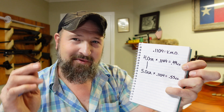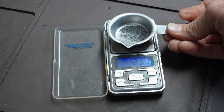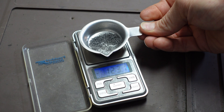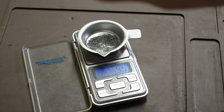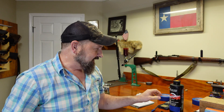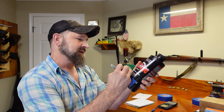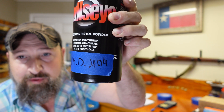Now we just take a measurement of each setting to see how accurate it is. With the measure set to 0.44 cc's, we get about 3.9 grains — I would say that's pretty accurate. Jumping up to 0.55 cc's to capture our five grain max charge — we get 4.9. I would say that's pretty dadgum accurate. So now you can know the density of your own powder, and we'll go ahead and label it. Got a little painter's tape here — VMD 0.1104. I'll use that number to set my powder measure to any charge weight I desire.